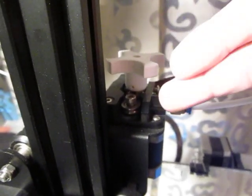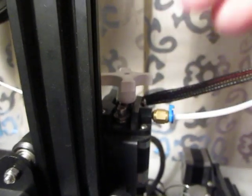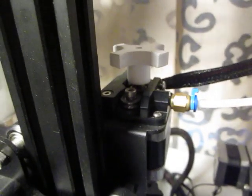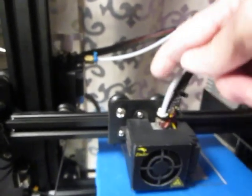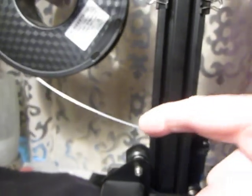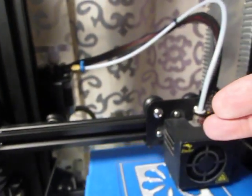There's nothing wrong with the plastic extruder body. If the arm cracks, replace it — it's like three bucks and takes five minutes. You don't have to do E-step changes, stepper motor changes, gear changes, or calibrations. Just change the arm and leave it alone — remove and replace. You've got the white Bowden tube; this is all that's required to get the filament through with minimal friction. No arms, levers, or gizmos redirecting the filament. It goes from extruder through to the nozzle. That's it.